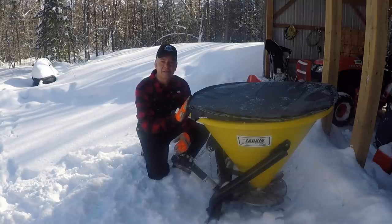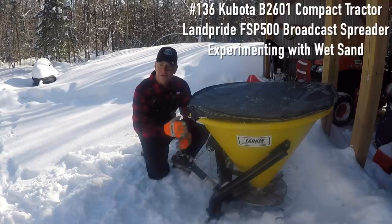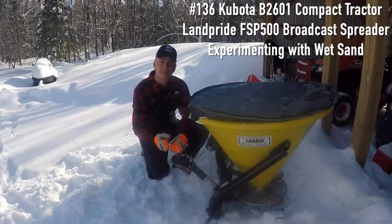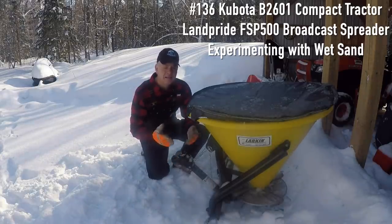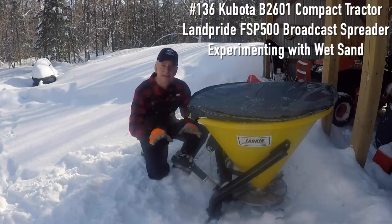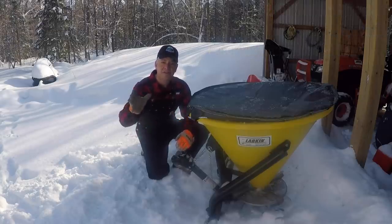Should be interesting. So you folks, if you follow the channel, you know that this is the first winter I've had this broadcast spreader, and it's been working great up until the last video. And I think I've used it 5 or 6 times. I put sand in it, fire it up, engage the PTO, I open the gates. It takes about 30, 40, 50 seconds, and the sand starts to sputter out, and then it starts coming out consistently. And then I do the driveway.